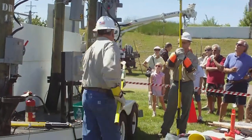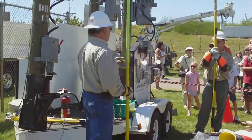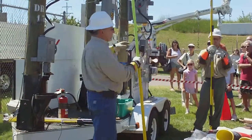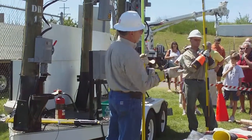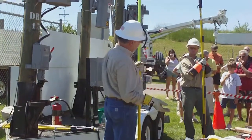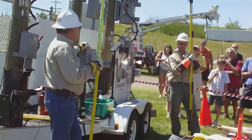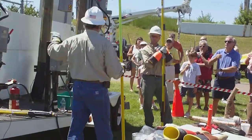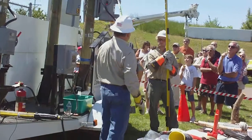Okay, now you see the lights are back on. OCR, oil circuit recloser. You're sitting there at night, power goes out, comes right back on. Goes out again, comes right back on. Goes out a third time, comes on, and then she goes out for good. That's what this does. We're avoiding nuisance tripping. If a tree comes, boom, it falls right down.